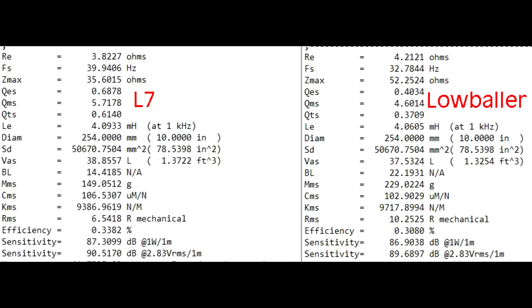Overall, this L7 came together very nicely and I think it will still sound pretty good. It's definitely not locked up like the other one was, and the other one was using a Chinese coil not rated for the temperature, whereas this one is rated to handle the amount of power they had on it because it's an American coil rated for 500 degrees — so it should get better performance overall and it'll actually stay alive. If you'd like to support this channel and all of our Tech Stuff Tuesday videos, you can do so through the link below on Patreon. Make sure you share these videos, hit subscribe, shop 24/7 at emfcaraudio.com, and I'll see you again on another Tech Stuff Tuesday.